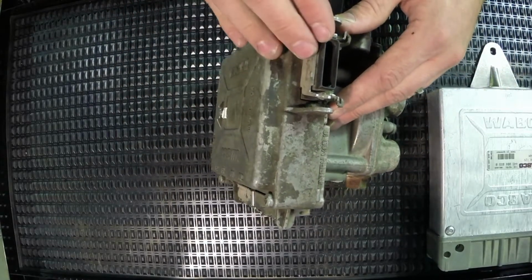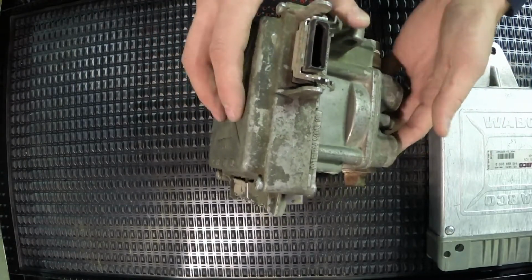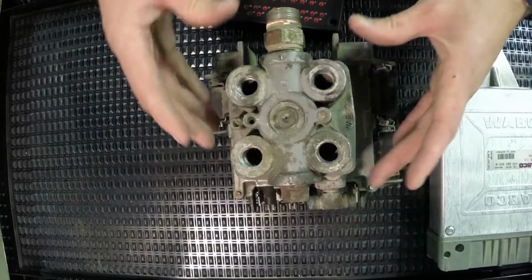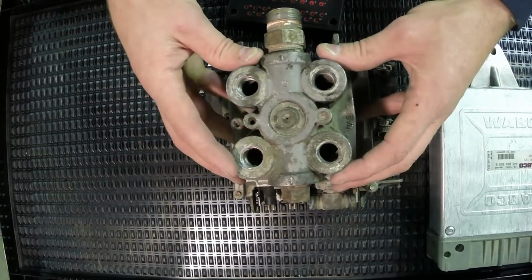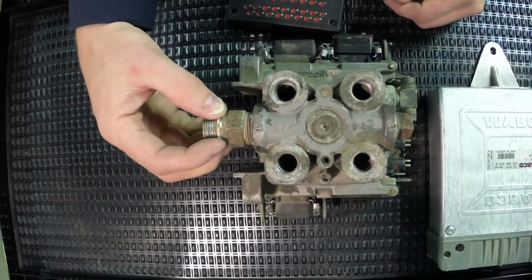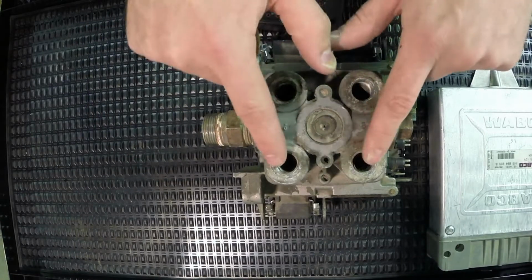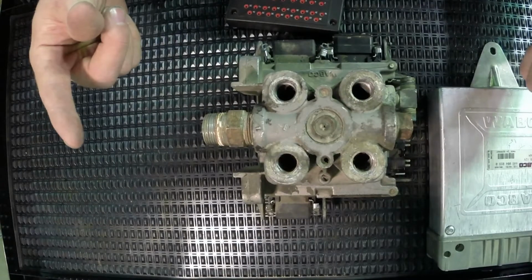So this would be allowing us to have a 2M system, because what we can actually see on the underside is our relay valve right here. And so our service relay is mounting here, we are able to connect to our air tank right here, and then our ports would actually be mounted to go out to our brake chambers on our trailer.